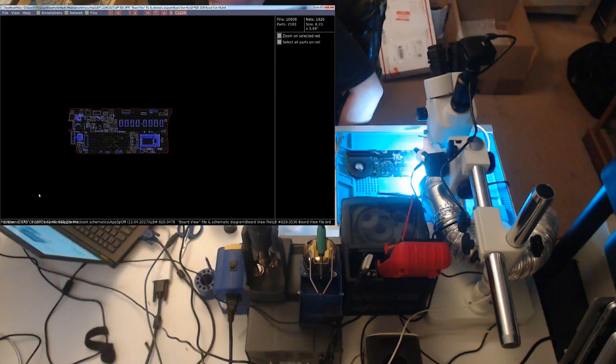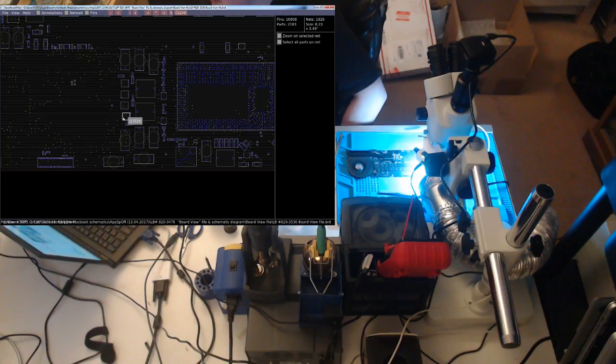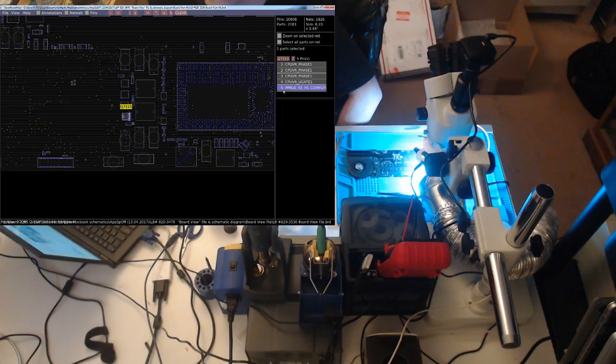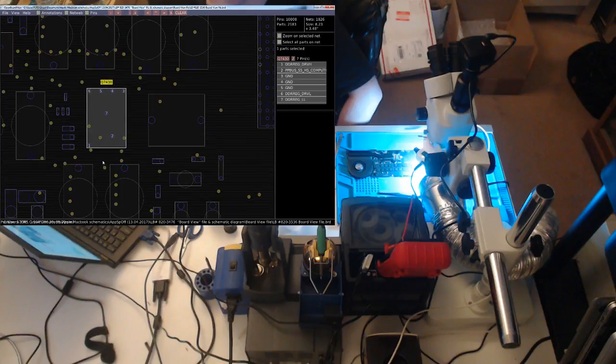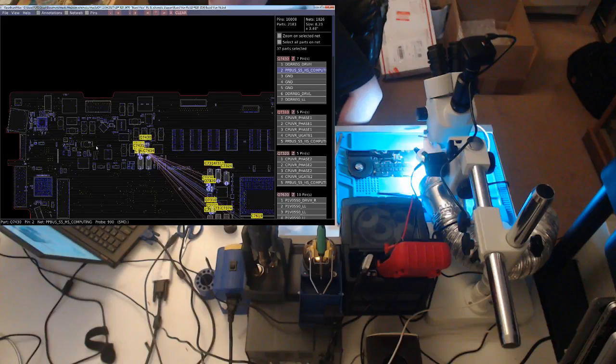Another thing, when PPBus G3 hot won't come on these boards, and you know your generation circuit is okay and you just can't get it to come on despite replacing all the MOSFETs, what I've seen is the CPU is bad. It ends up pulling too much current. This runs off PPBus S5HS computing. As you see, this is going to run off of your 12 volt rail off PPBus G3 hot. So I've had these exact same boards do the same thing. PPBus G3 hot's low. I try and restore it, and it ends up being the processor is bad.